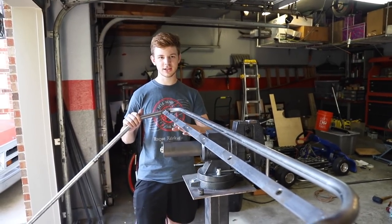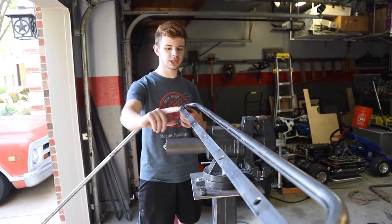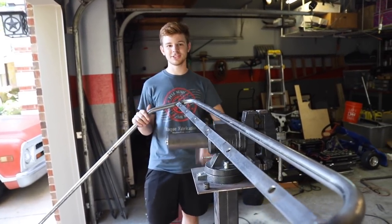Fitting all six lights is kind of a challenge, but what we ended up doing is taking a one-inch piece of angle iron, welding it across, and then doing the math to figure out the placement and drilling our holes. Now that that's all done, let's mount these lights.